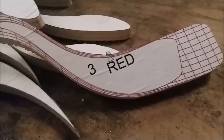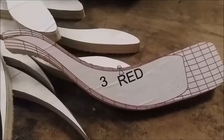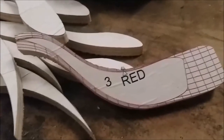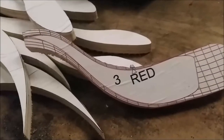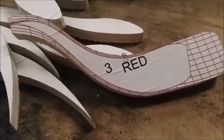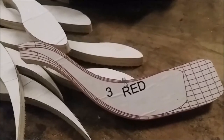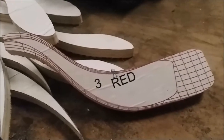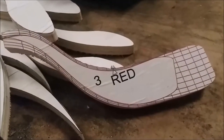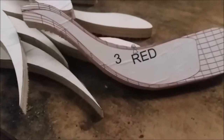So it's going to make a stack of these blocks that look like stair steps, and then you take a 26 or 24 or 36 grit closed coat disc on a sanding pad on a 4.5-inch angle grinder like a Milwaukee we got, and you sand it until you get down to the bottom of that notch all the way around. Now, we're not going to have this paper on here, hopefully by the end of today.